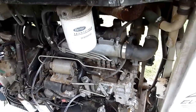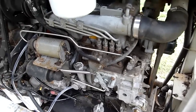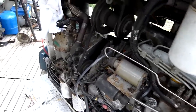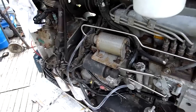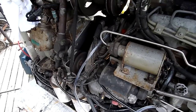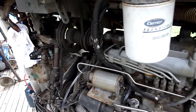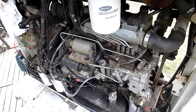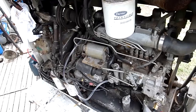The computer will first establish that it's warmed up enough — above 22 degrees Celsius or something like that — and that it has oil pressure before it goes to full run speed, otherwise it will shut off. It'll shut off if there's no oil pressure, and it'll just continue to idle if there's no heat in the engine block, like if it's just really cold. It'll sit there and warm up before it goes straight to run speed, which is really cool — really smart, and just a great idea. It saves the engine undue wear and tear.